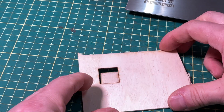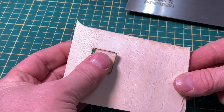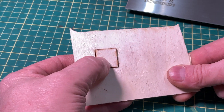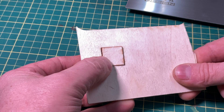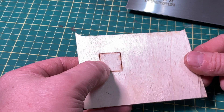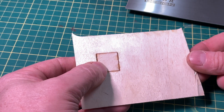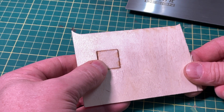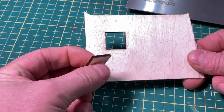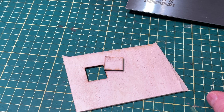The last thing I did was a cut on Baltic birch — just a single pass to cut three millimeter. There's almost no kerf; the beam is incredibly small and it's pretty tight from a kerf perspective. That's definitely an improvement over a CO2 laser. Of course, you wouldn't be able to cut nearly as thick or as fast with this. But for this kind of work, there's very little charring on the sides. I'm impressed. So that's a bit of sampling.